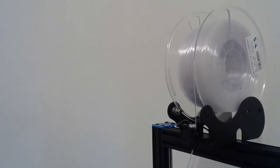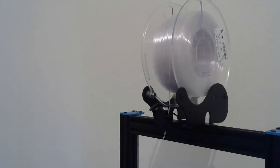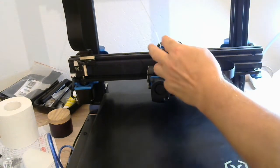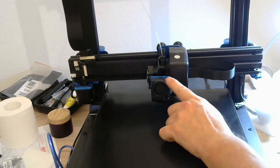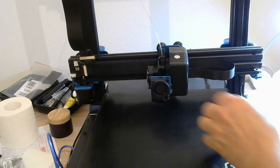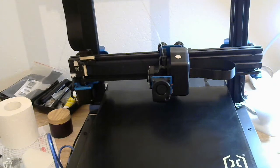The plastic up here is PETG, which is what soda bottles are made out of, and it's completely safe for contact with food and drink, as you see with your soda bottles. And for anyone not familiar with a 3D printer, what this does is the filament, this plastic, comes down into this head, which is over 200 degrees centigrade, is melted and squirts out a little nozzle on the bottom while this table moves and this head moves to make the item that you want made.